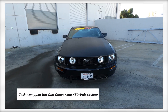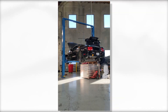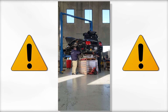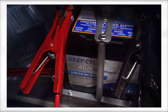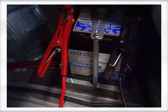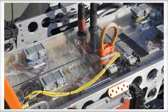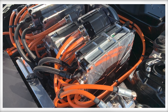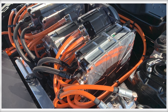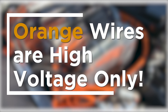Once you're properly trained and have fully de-energized the system and checked voltages, they can be perfectly safe to work on. But until then, use caution — think of them as high pressure fuel lines. You may think your ICE car has orange wires in the 12-volt system, and you would be correct. But EVs don't use orange on any wiring except the high voltage system, so please don't get them confused. When wiring an EV conversion from scratch, remember that orange wire is reserved for high voltage only, and we'll go over this in more detail in our next video.